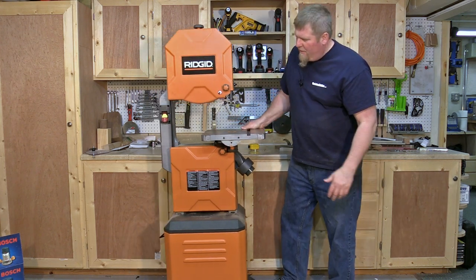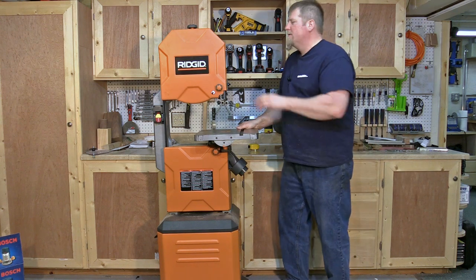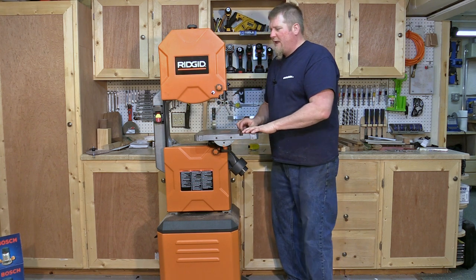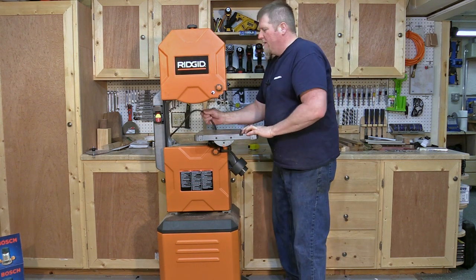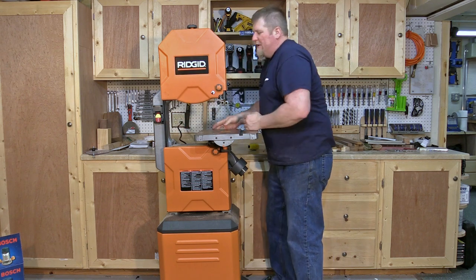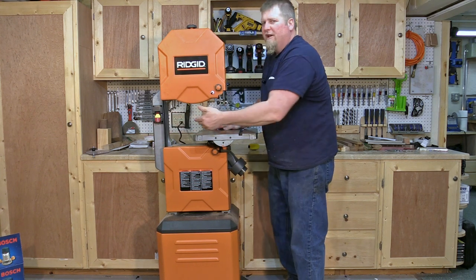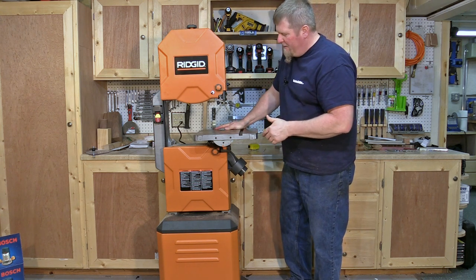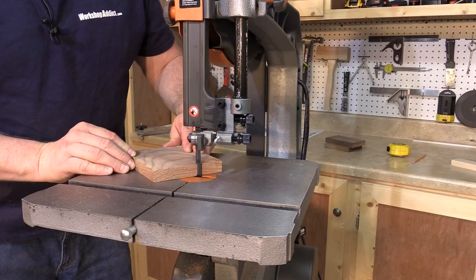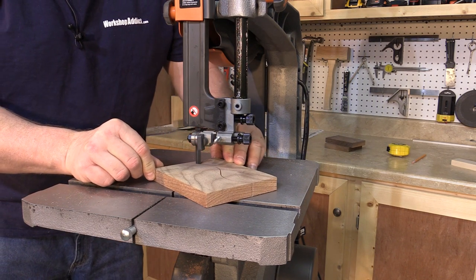For an entry-level unit, having casters built in is something I'd take over a rip fence right now, since you can always get an aftermarket fence. The common 93.5-inch blade size gives more selection, and the bearing adjustments are easier than my last unit. Everything else is pretty standard. One other thing: there's a plastic sleeve in the back where the blade runs through, and I wish it were more rigid — when running you can hear it rattling, catching a couple teeth. It's just a little annoying. Other than that, this unit works really well. I tracked it earlier and I don't have any blade drift. For the price, I'm happy with it.